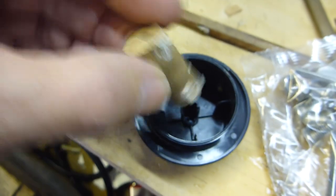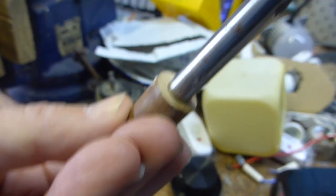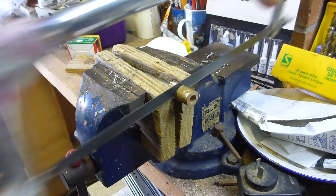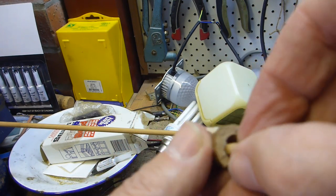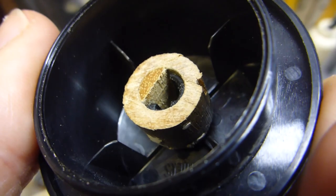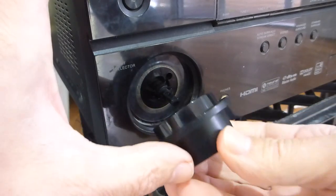The function control knob is broken. I've got a bit of leftover wooden dowel that I'm going to drill out and make a sleeve — slip it in. Kept going up in half-millimetre sizes and found a 9mm bit is perfect for the sleeve. Found another piece of dowel, cut a little cord that fits in, glue that in, and that will become the new piece — just keep filing it flat until it fits. That's the finished product.